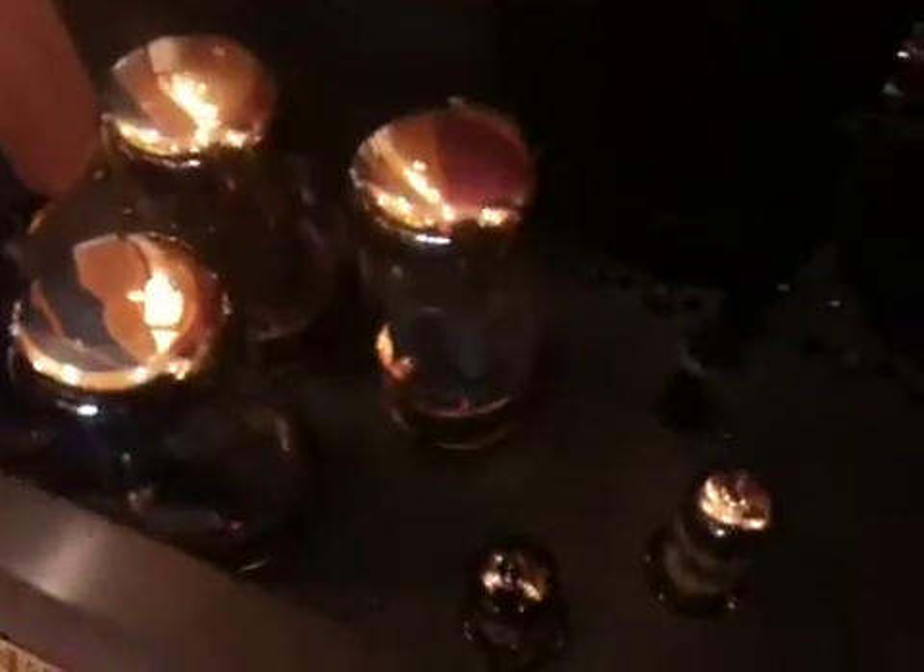A couple weeks ago, when I re-biased and cleaned up and tested all the tubes, I found a couple of weak tubes, so I've replaced these two smaller tubes in the center here. One of them is a 12AT7 and the other is a 6350 tube — those are the driver and phase splitter tubes. I don't expect there to be a big difference in the bias because we're not adjusting the bias on these tubes.